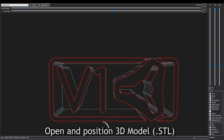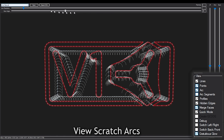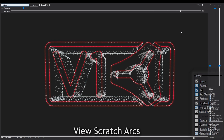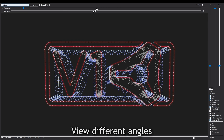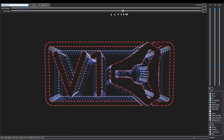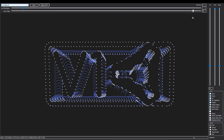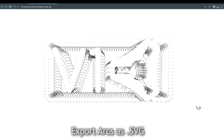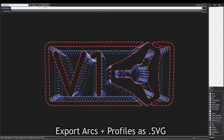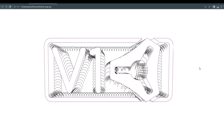Start the Holozens app, open up your 3D model, position and orientate it in a way that you're happy with. I find having a flat surface at the front is good for having the arcs not make a big mess of things. Play around with the viewing angle, look at it from various angles, make sure you're happy with how much it's going to rotate. Then you'll want to maybe just temporarily disable the lines and profiles so you can appreciate how the glints of light are going to reflect off those arcs. Once you're happy with everything, export as an SVG. I find it helpful to enable the profiles so you get that nice outline, which can help even if you've got less than ideal viewing and lighting conditions.